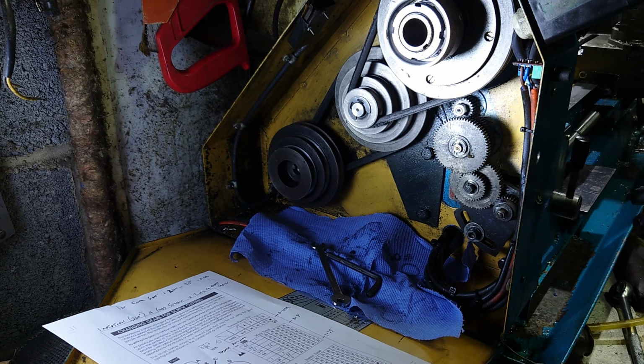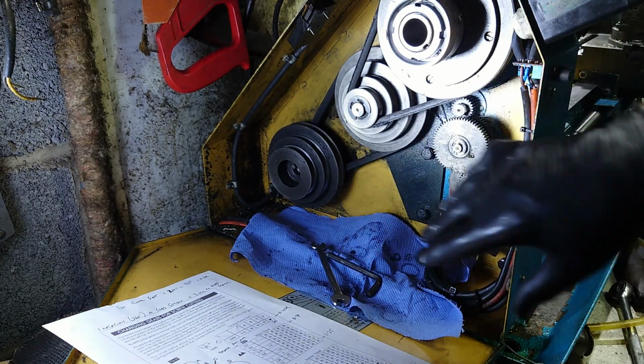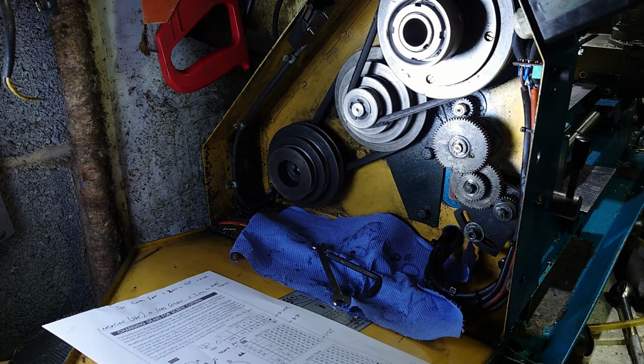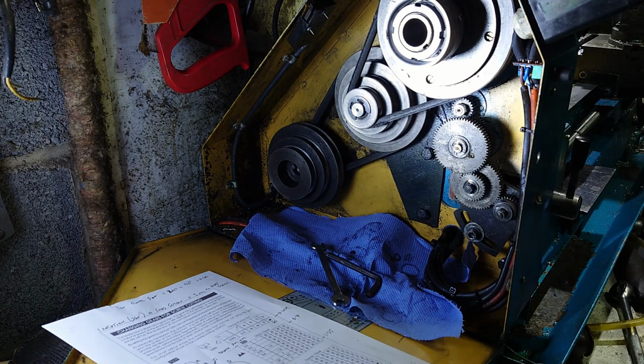But modern lathes, I think the gearbox is integrated. So you've got gear levers at the front to select your various ratios, and it's all very controlled. You don't have to go getting your hands dirty. They're three-phase, you've got a motor controller to alter your motor speed, and you've got an inbuilt multi-speed gearbox, and you just select what gears you want to work with. But I can't afford those, so you make do with what you can afford.